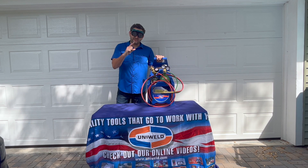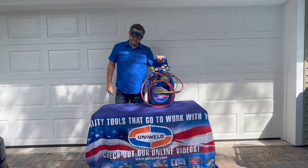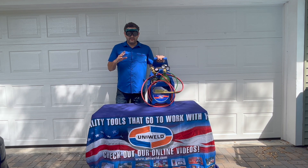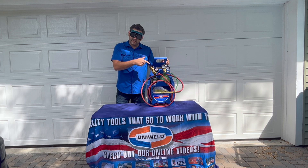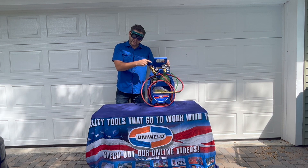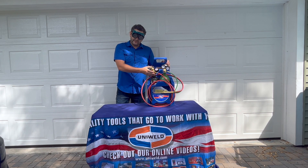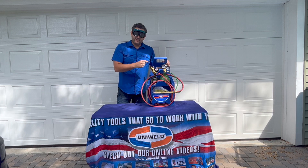What is up everybody, this is your pal Sal with PED Associates, here to talk about tank safety with my oxy-acetylene kit from Uniweld. I want to show you how to leak check your tanks before you get started brazing or soldering, or do any type of fire work or flammable work inside someone's home. You always want to leak check both your regulator and your tanks, as well as your handle and your hose before you get started.